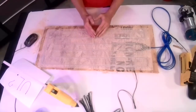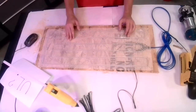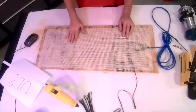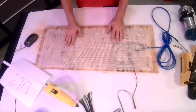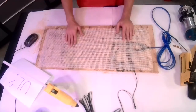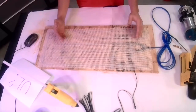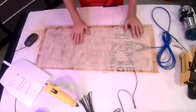Everything that is on that electromagnetic spectrum is technically a form of radiation. What you're thinking of is that real high-level radiation, which is the gamma rays, the X-rays, UV light. Those are the things that are in the ionizing radiation category, which can cause cancer. When you're down in the radio waves and the infrared light, it is very different, very separate. So you do have to remember that technically you are being heated by infrared radiation every time you walk out in the sun. The only problem with the sun is the ultraviolet light component there as well, but it is still technically radiation that is heating you.